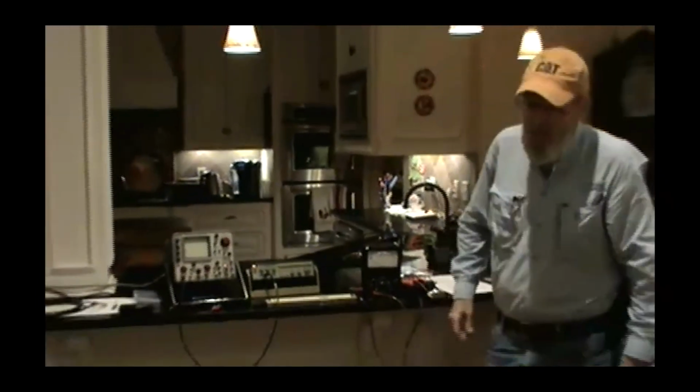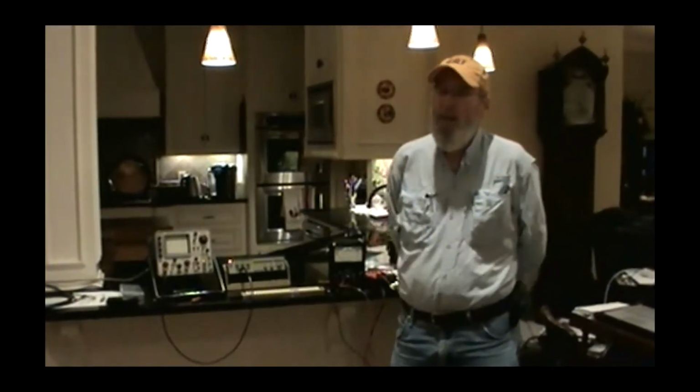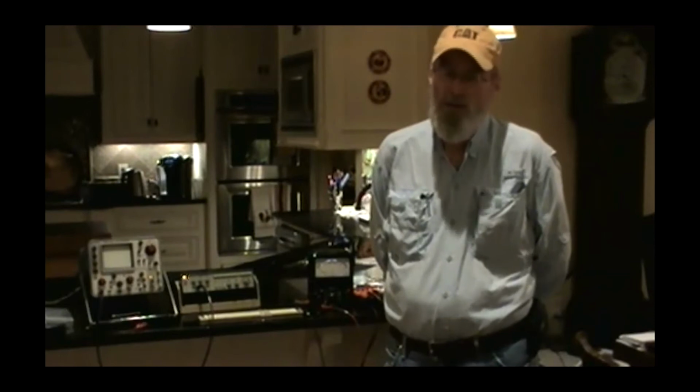But anyway, that's for measuring RF power and adjusting your loading. Because if you set that display up and you see a bunch of flat topping, you know you're misloaded or mistuned. I know Kenwood, Heathkit, and I'm trying to think who else, several manufacturers either used to make or still make station monitors that are basically specialized oscilloscopes with appropriate connectors on the back to leave in line and pick a signal off so that you can continually monitor your output.